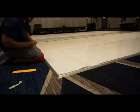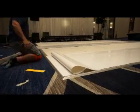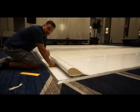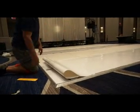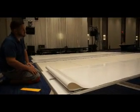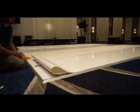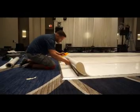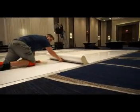This is the key important part of laying the floor wrap down. You want to create a big enough curl so you can pick up your large squeegee and put it up underneath. If you have an extra person, it's most helpful to have them on the other end. Once you get your curl, go down to the end and secure the other end so the curl doesn't come up. The most important part of the technique is having this curl. You're going to have the squeegee in one hand in case there are bubbles along the way, and you just push it all the way down.